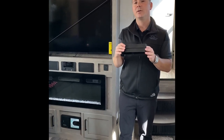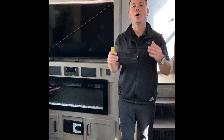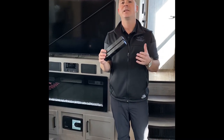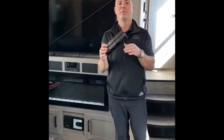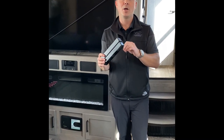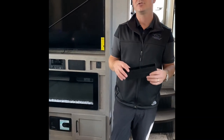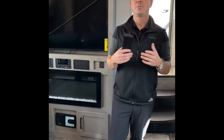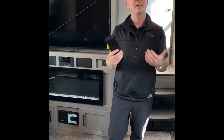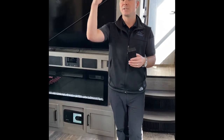This is a system that we designed in our engineering lab on Complex. This is going to be something completely different from what everybody else is doing in the industry, simply because most people are going to be taking those ducts and just taping them with foil tape. The problem is over time, when you're in conditions of hot and cold, the stickiness comes apart. That's where you get those air leaks.